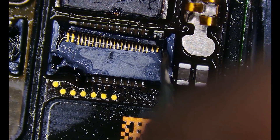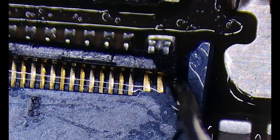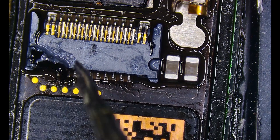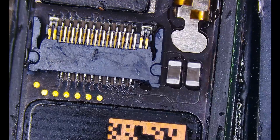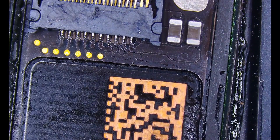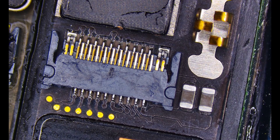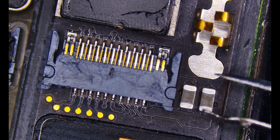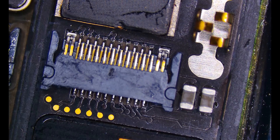Just like that on that side, and I'll do the other side the same way. Just in case I break this one I have the other one I pulled as a backup. The reason I do that is because I'm going to be heating this up and that will definitely melt the plastic, as it's much less heat resistant than the rest of the connector. We'll dry off the isopropyl alcohol and get ready for the extraction of this connector. This process can be done with any device anytime you're replacing one of these type of connectors — even any connector that has plastic and metal. As long as you take your time and you've got the right temperature and flow, you're going to be okay. I'm going to set my rework station to around 350 degrees Celsius and take the airflow significantly lower than normal to get an even heat across this without burning any of the plastic.